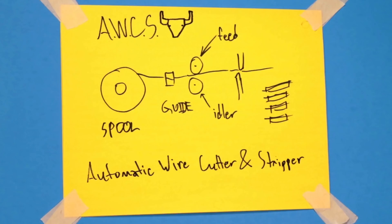Let's figure out the plan for our machine. We'll probably need something to hold the spool, something to guide the wire, and then something to actually move it through the machine. I think we'll use two rollers — one will be an idler, and the other will actually feed it. And then we'll need some sort of blade mechanism to actually cut the wire, and then we should get individual strands that have been stripped.